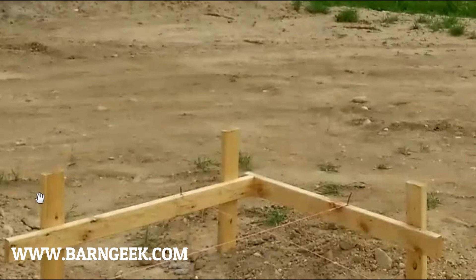What you have here is three 2x4s with a sharpened point that you attach across another 2x4 to tie them together, and then pound those into the ground. Then you've got another 2x4 that you attach to this one, and pound that other stake into the ground. Make sure that you make this batter board top ledger level — use a torpedo level when you run it into the ground. It's best to just drive the stakes in first, and then attach the boards level after that. It'll help with the layout of your project.